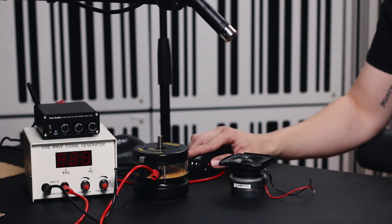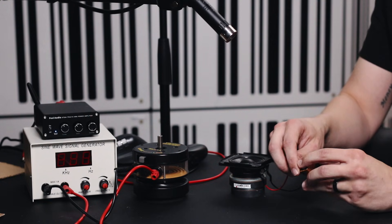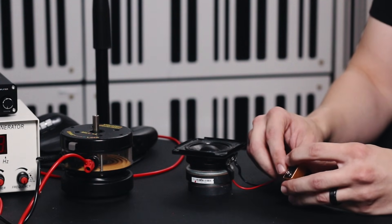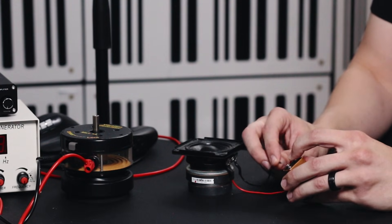Typical music is a very complex signal that contains various frequencies, so let's look at the behavior of a speaker with a much simpler input signal. We can start with DC, or direct current, that's supplied by a battery. I wouldn't recommend using a 9-volt battery like this on your own speakers, but it's going to help me make a point. The speaker has a red wire and a black wire — these are the two ends of the coil within the speaker. The battery has a positive and a negative terminal. When I touch the red wire of the speaker to the battery's positive terminal and the black wire to the negative terminal, the speaker cone moves outward. When I switch the wires, putting the positive terminal to the black wire and the negative terminal to the red wire, the speaker cone moves inward.